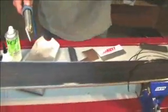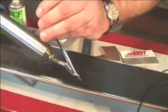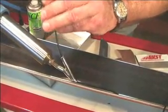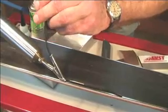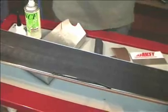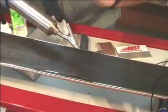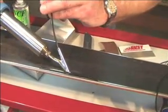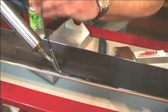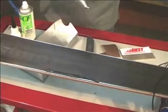Your anchor weld now will be against the edge to start. Same thing, start about an inch ahead. Lay your anchor weld, and then hold your welder at 45 degrees to the anchor weld. That'll melt everything together. Always switching to a cool piece of welding rod.